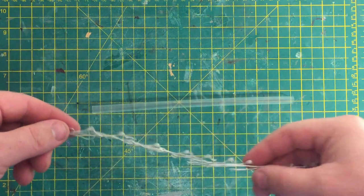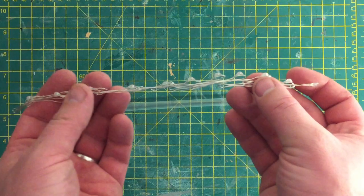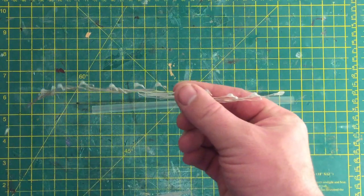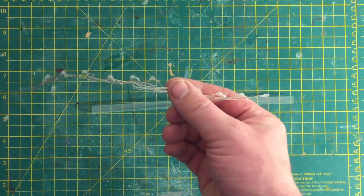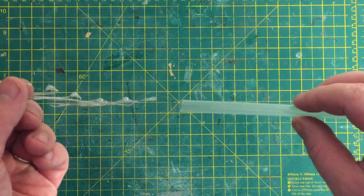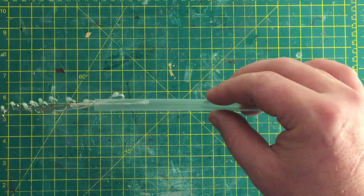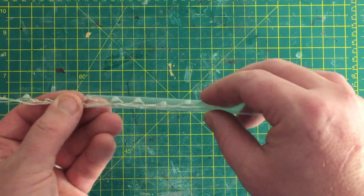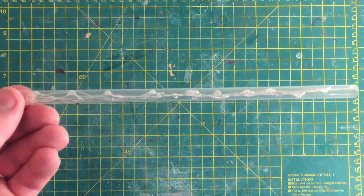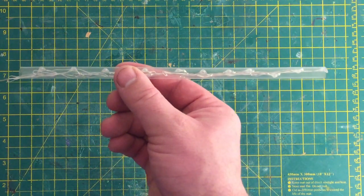So once you've folded all your LEDs together like so in a nice thin line, make sure your wire is all bent and nice and thin, because this is going to be threading into there. Because you've bent all your wires, you might just want to check it still works, which it does. And then next step is to thread them into the straw. And there you go, that's all your LEDs threaded in. And then switch it on.